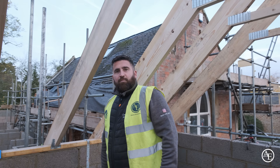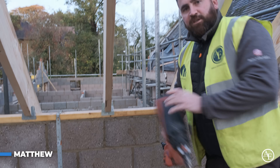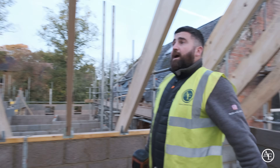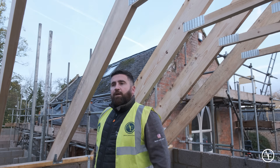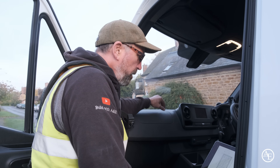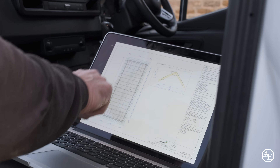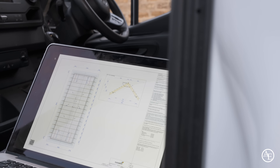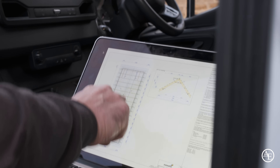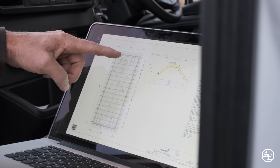Morning everyone - so back at it today, we're going to be finishing off the rest of these clips. We've got truss clips on here, we've got the positive nail ready, we're going to put a positive nail on every single one of these holes to strengthen the trusses up. Then me and Tony are going to get the bracing done from the bracing plan. We've got all the trusses in with the lateral straps in. Matt's just finished all the truss clips. Now we're going to look at all the bracing - you can see it runs like this. From the back of the garage roof you've got seven trusses - on the seventh it goes all the way up and back down again. Then that seventh point and then another six. Exactly the same pattern.